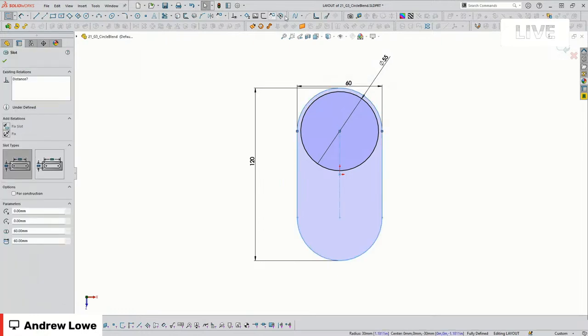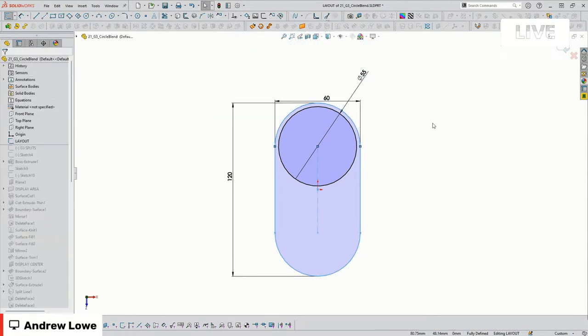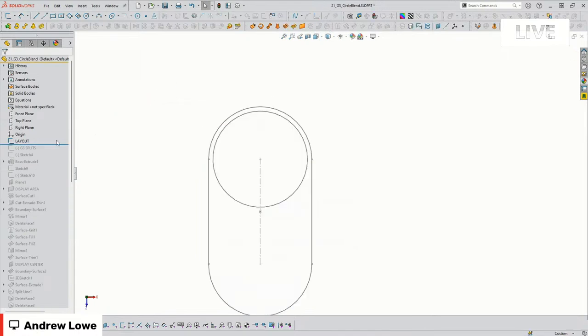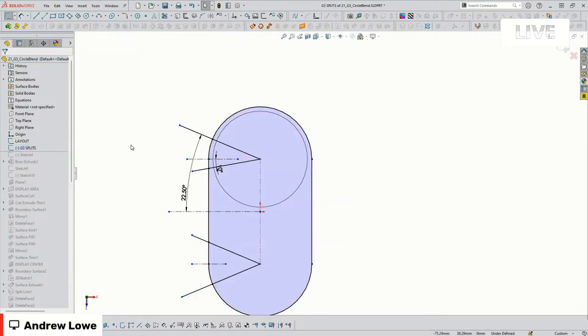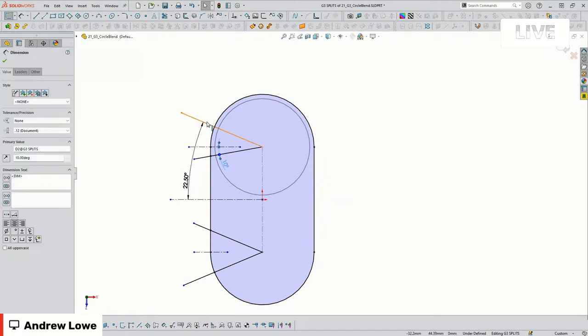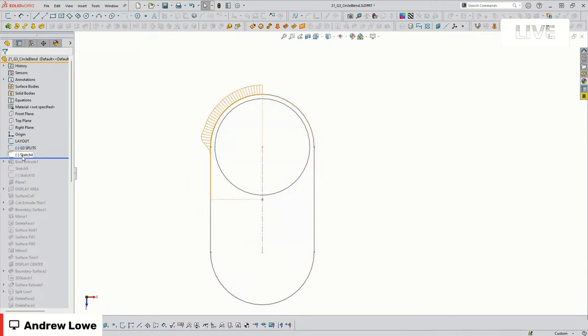But if we were to look at the curvature of a slot, once again, I have this very abrupt transition, and I want to smooth that out. So I need to create a transition where I have a portion here that's being replicated by a style spline rather than an arc. In the same way that I used the fillet tool at the sketch level to call out a larger transition, here I have some lines being used to split out a little area that I'll replace with my G3 connection. I'm just using some angles here to fully constrain these lines. Okay, so I have my splits. This is the little area where I need to create my G3 transition.